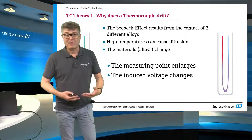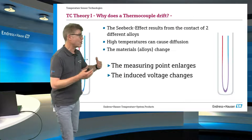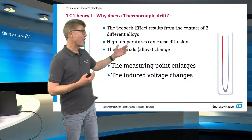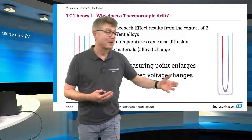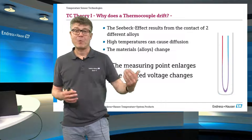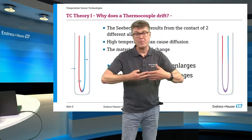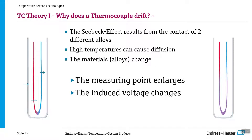After a year in a red-glowing environment, strange things can happen because these two alloys exchange material. So after half a year, after one year, it's not red and blue any longer — it's fifty shades of violet, because, for example, the chromium walks from one side to the other. And so at the end, the alloys come closer together and produce less thermoelectric voltage. The result is that the produced voltage is too small, and so we have a negative deviation of the sensor.